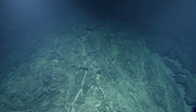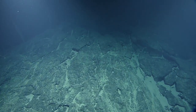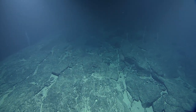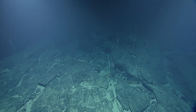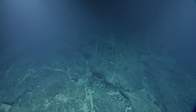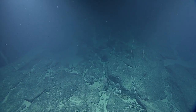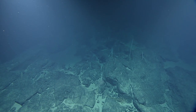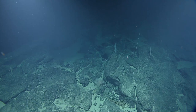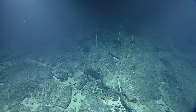Might need a reset soon, though. I don't know, but the pings are kind of all over the place. Yeah, the EKF would be nice to have, even as another reset source. What's EKF? I have a Kalman filter running for the mapping. Oh yeah, and that's the green line that you're seeing in HyPack, the Kalman filter track, which does not need to be reset. Why don't we have a Kalman filter on the... I don't know. We used to. We did it at shakedown, and then they upgraded NavG, and it didn't get ported.